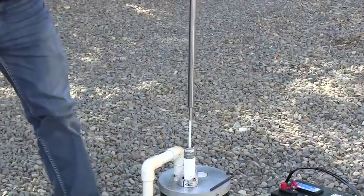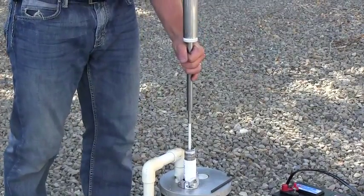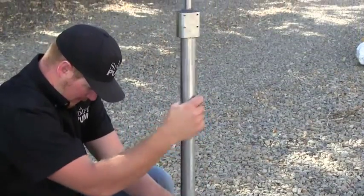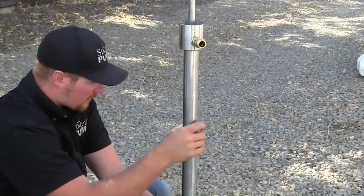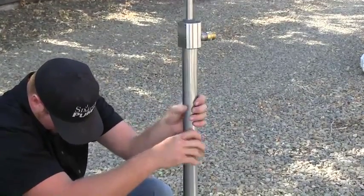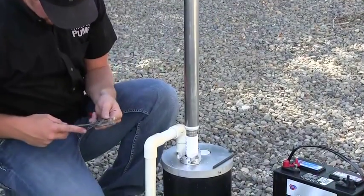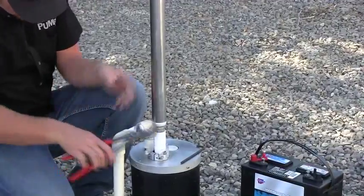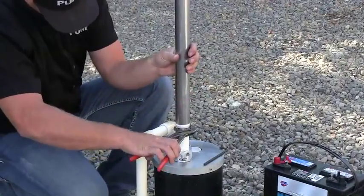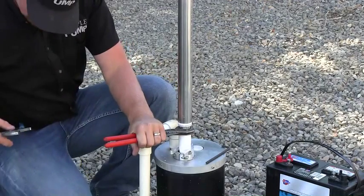There are no flats on this rod. The pump head and riser tube are installed, making special precautions to orient the top end of the stainless rod. The top end has a little bevel to make it easier to get it past the two U-cup seals in the rod gland without damaging them. The riser tube is now torqued onto the stainless nipple.